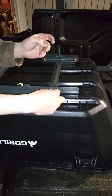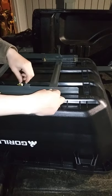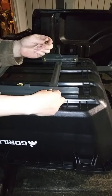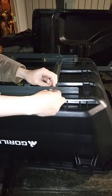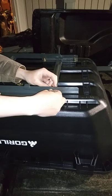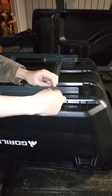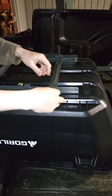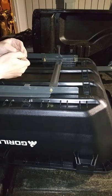You just put your little metal washer on there, and then you're locking it. And again, always try to do this stuff finger tight. I know I just bolted it down with the impact, just for demonstration reasons. Put everything on finger tight, and then when you're working with locking nuts, go back after you're done, after you get it all assembled, and retighten everything up.